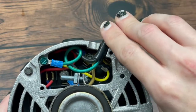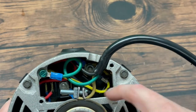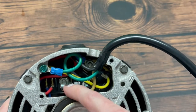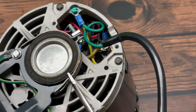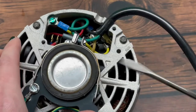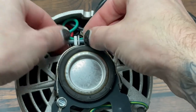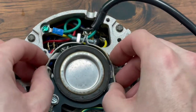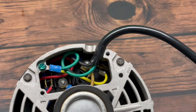As you can see, there are really just three nuts we're going to be working with. It's the green one, and we've got one here connected to the white and one connected to the black. Now this white one is going to be kind of hard to access because of this bolt right here, but this one is easy to get with a flathead screwdriver. Move that out of the way so now we have free access to all three of the nuts we need to work with.